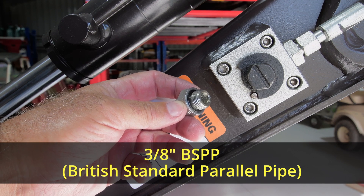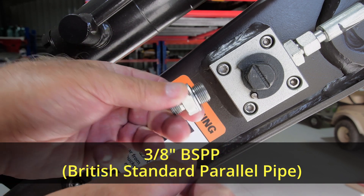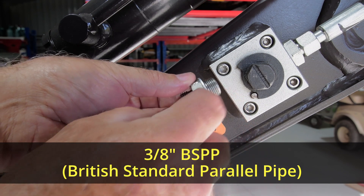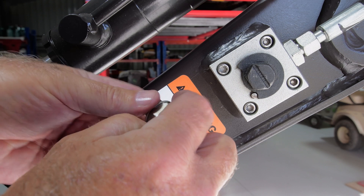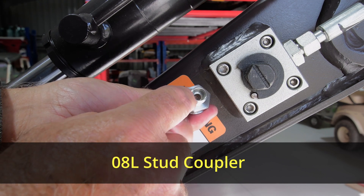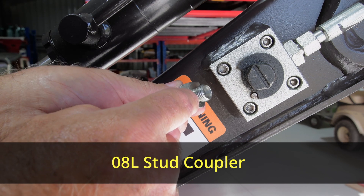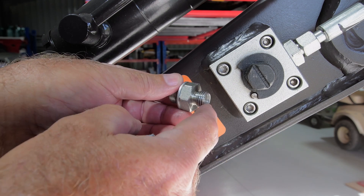This thread is called a three-eighth of an inch BSPP — so that's British Standard Parallel Pipe thread — and because it's a parallel thread the seal is actually from this o-ring that sits here, and then a metal ring sits on the outside, and that gives you just enough when it's sealed up that that o-ring stops any oil leaks. On the other side it's a smaller connector and this is called a metric light connector. How this is measured is on the inside diameter of this opening here, which is eight millimeters, so this side of the connection is called an eight metric light connector — and that's what currently is the same as on all the pipes and hoses that go to our attachments.